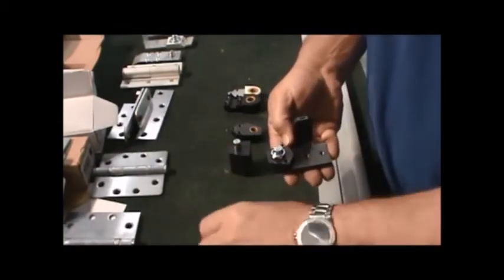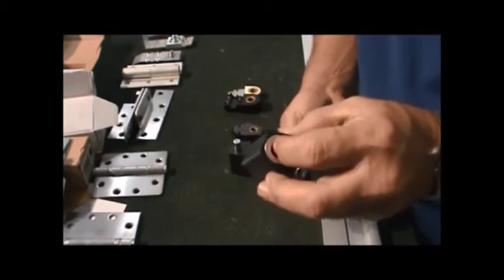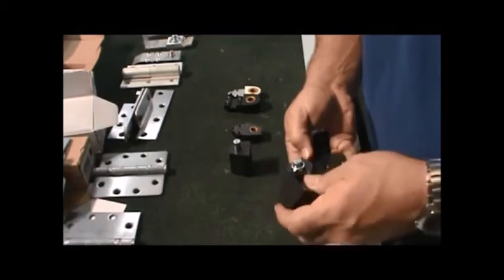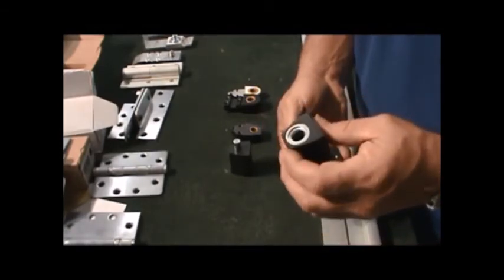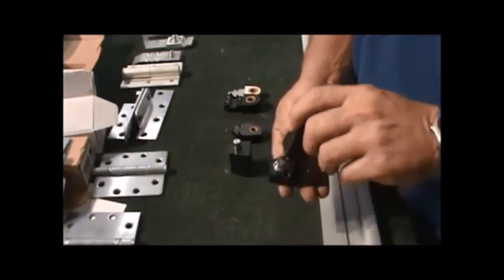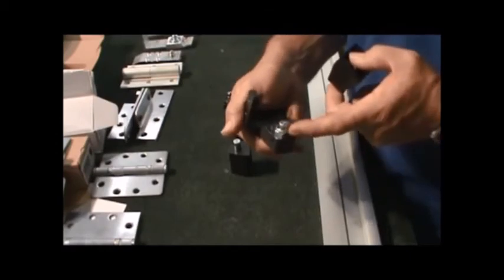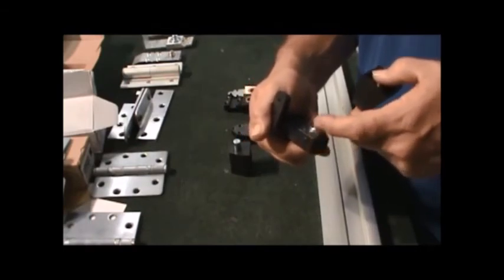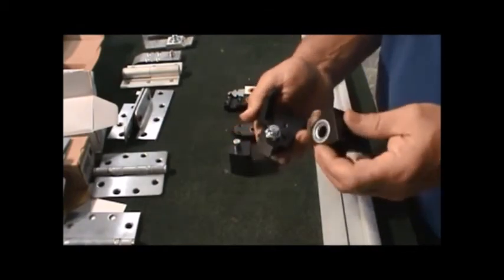Well, the door has a pivot point, which is the top part of the bottom hinge. If you can see this right here, this is a bushing with bearings. This actually has ball bearings inside of it. You'll see storefront doors getting lower and lower and some funny stuff coming out the bottom, and it looks like the door is going to fall off. That's because all those ball bearings have worn down so much that they're no longer working, and the door gets harder and harder to use and starts rubbing on the threshold and whatnot. That part right there rides on that nub, and on this particular one there is an adjustment screw. You would have to release that to adjust it up. But this is only really supposed to be used when you're first installing them. If the door is getting lower and lower after that, it's because you're wearing out your ball bearings and really need to replace the pivots.